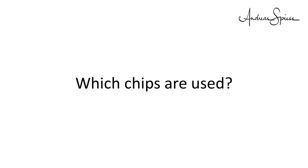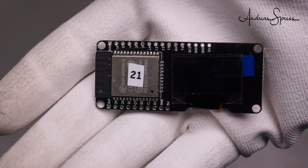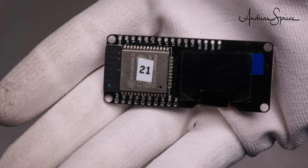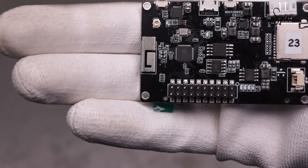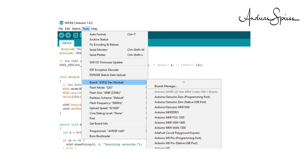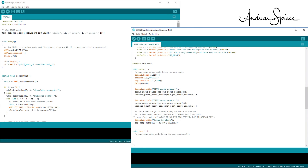Next, which chips are used? WROOM32 modules — here all components including the antenna are placed on a module, which is shielded and FCC certified. Alternatively, ESP chips are soldered directly on the PCB, which probably reduces manufacturing cost. Especially TTGO seems to like this concept. To program all boards, I used the ESP32 dev module board definitions. For my tests I used two different sketches: one to check the display and one to measure the current. The sketches for the displays are different for all boards because they need various libraries or use different pins. For your convenience, I posted these sketches to GitHub, so you have a head start.